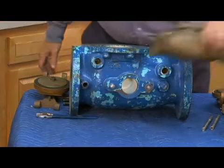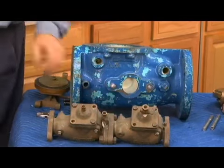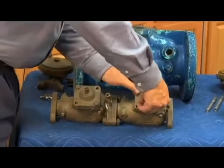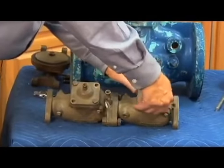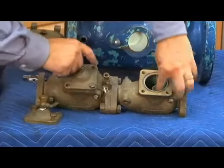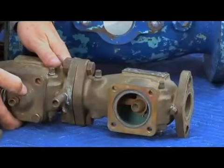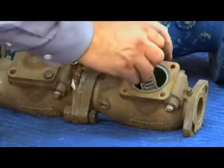As I mentioned, the 3/4 through 1.5 inch utilizes a poppet style check, but they did use a 3081 style check on the small sizes, 3/4 through 1.5 inch, in the early 70s. As you can see, it's the exact same toggle lever mechanism, except small. It was not used very much, not sold very many.